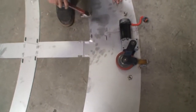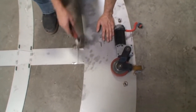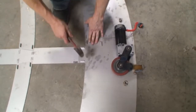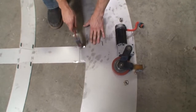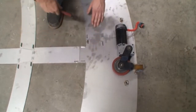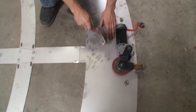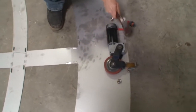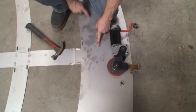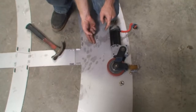With everything in place, fasten by hammering down the tabs away from center. This tab is considered bent away because this is a track on which a wheel rolls. If the tab is bent inward, the wheel will be forced to roll over it.